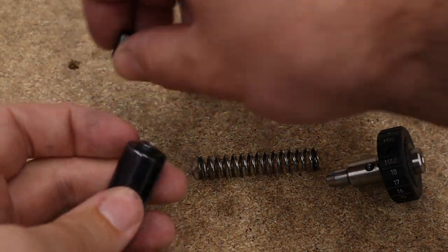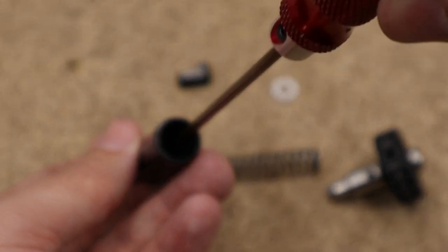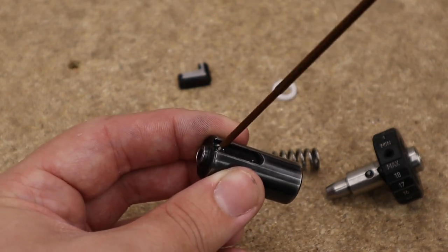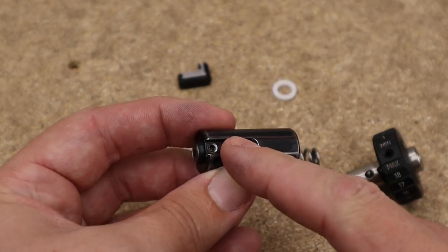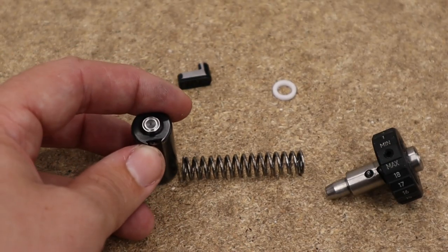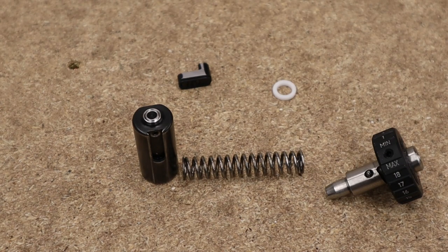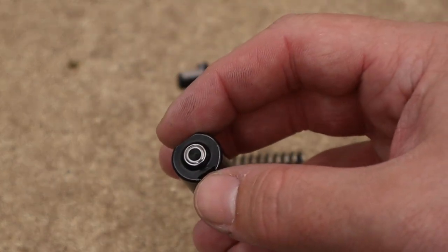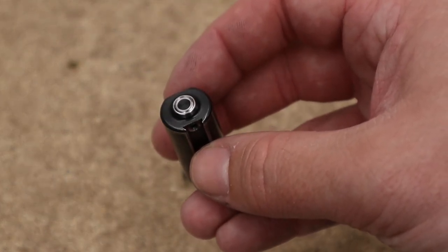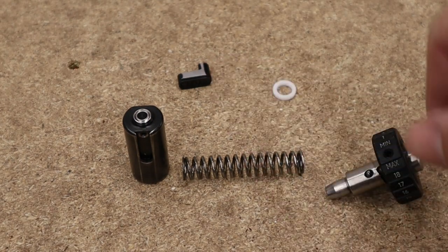I'll put it together so you can see it all in one place. The locking screw at the moment does tighten directly onto the threads of the adjuster screw, so that's not ideal, but when we remake the hammer that's something I'm hoping to fix. For now we had to do it that way as there's not much meat between this section and the threads — not enough room to fit a Delrin or PEEK packer in there — but we'll sort that out at a later date.